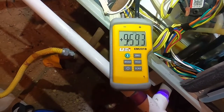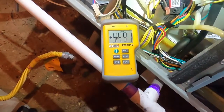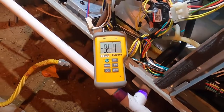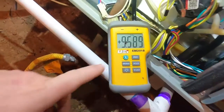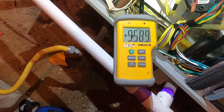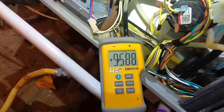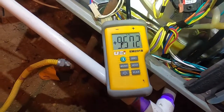So I've got to wait for this thing to stabilize out, then set that gas pressure at 10 for LP. I need to get the book — I can't remember what the low setting is for LP gas — but we'll wait out the five minutes, then get it set up and check the low stage.